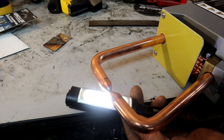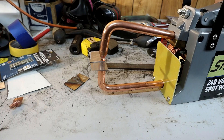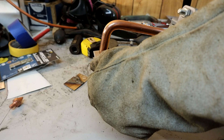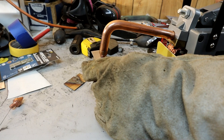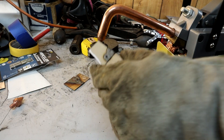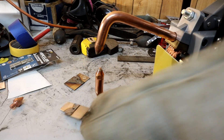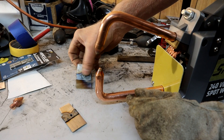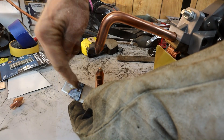That's pretty good — we'll do three seconds. I also noticed from watching some tests on YouTube they were getting a lot of sticking, and I think that was just because the metal was dirty. I don't seem to be getting that too bad. That's three real close ones there. Let's go over to the bench and put them through some torture. I see I pressed too hard there and it burned through a bit.